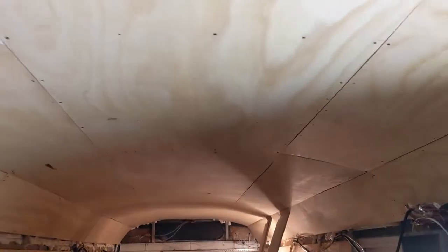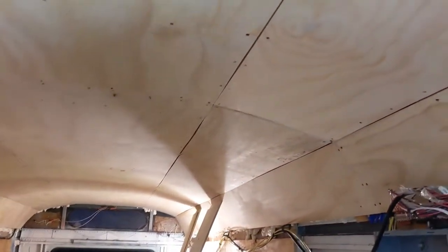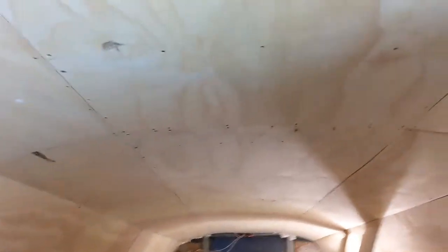What I'll do now is drill the holes for the lights. I marked them as I went — kind of rough reminders of where they go. I marked where the hat channels are so I can do diagonals to find centers, then marked rough X's where the lighting needs to go. I'll refine the spots from those diagonal marks with a straight edge and then drill the holes carefully. It turned out pretty well and I'm pleased with the progress — it went up quickly.